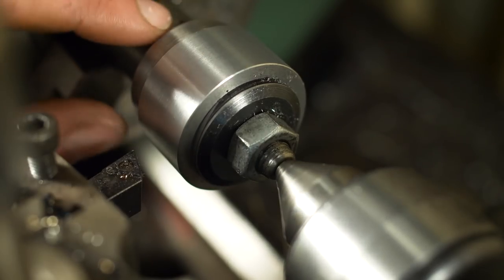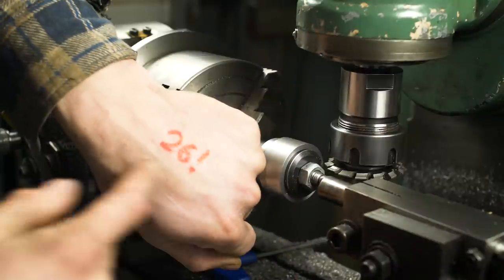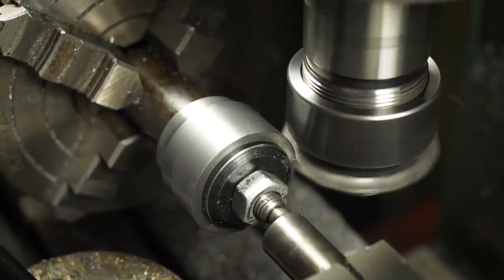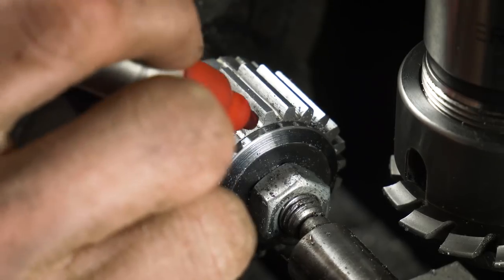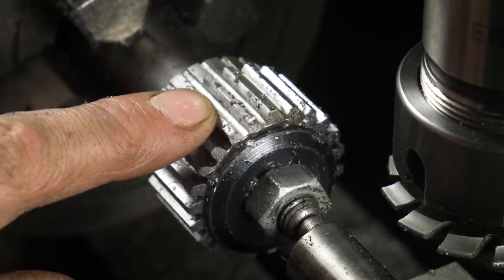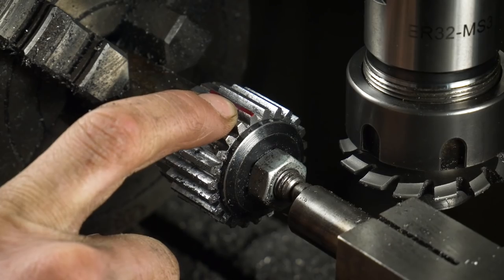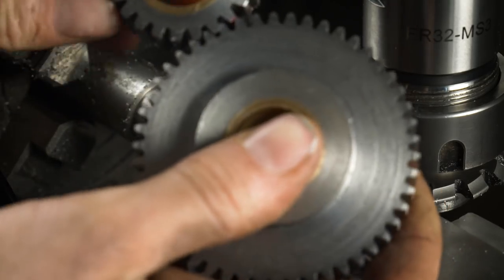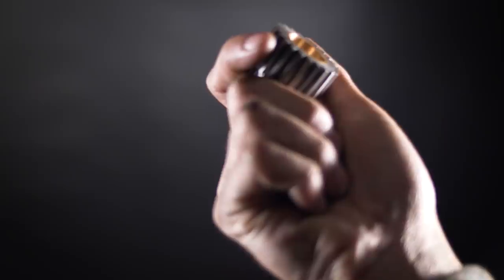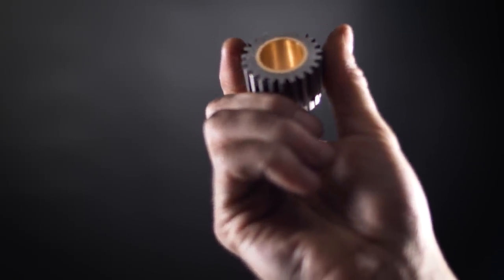Now that we've got this, I'm going to take it back to the mill and try and cut this again. Now to cut teeth - we need 26, that's a lot. One, two... twenty-two, twenty-three, twenty-four. It's one of those days. The screw up this time: I read the wrong section out of my dividing chart. No, I can't really use this. Scrap gods, we offer this gift up in hopes that we may find future parts of use to us. Long may we scavenge. On the plus side, I was able to make the gears to the original plan, and then I had a lot of deburring to do.